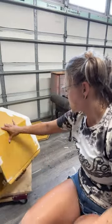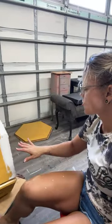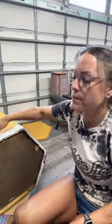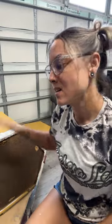So here she is, we'll spin her around again. This is gonna dry. I will lightly sand with a 220 sponge. The Dixie Belle sanding sponges, they're foam on the back so that you don't tear up your fingers. And then they come in 3-packs or 1-packs from the Dixie Belle page, so you can order those from there. How long will that take to dry? I'm gonna let this dry overnight, I'm not gonna touch it. So I'm gonna give it at least 24 hours, I'm gonna sand it back, I'm gonna apply another coat, I'm gonna sand that back, and then I'll probably do 3 coats, to be honest. There's so much damage, I want it to be as smooth as possible.